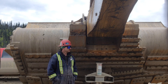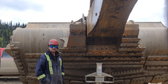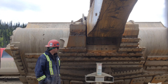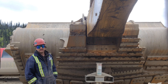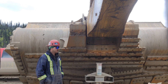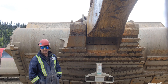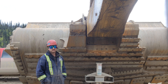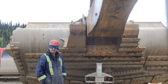I've got a nice easy job today. I'm just going to be doing some work on this 992 bucket — one of our front wheel loaders. We've got two of them here; the other one's getting tires on it, so it's going to be a little bit of noise today. We're doing some maintenance on it. There's some cracks that I found, as I'll show you in a little bit. We'll do some grader blade inside the bucket for some wear — a little bit of gouging, a little bit of stick welding for the cracks. And then I'll be using 1/16" flux core for the wear plates. There's going to be a lot more welding there, a lot quicker. We won't be at it all day.